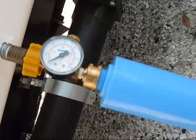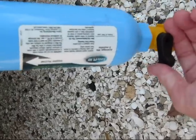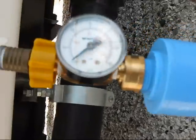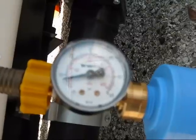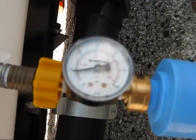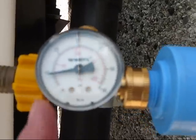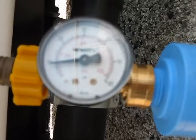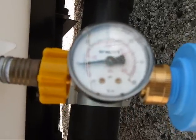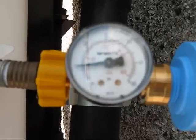I do have a pressure regulator on the hose where it connects up to the water supply, so I have one there that cuts it down to 45. Then here again, when it goes into the trailer, I'm cutting it down to 25, because I don't really feel you need 40 pounds or whatever going into the trailer — 25 seems fine to me. Now I'll turn the water supply on, and you can watch the gauge go up. You'll notice it's staying pretty low, only at 10 pounds right now because we're filling the tank.